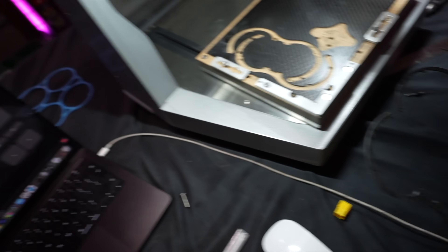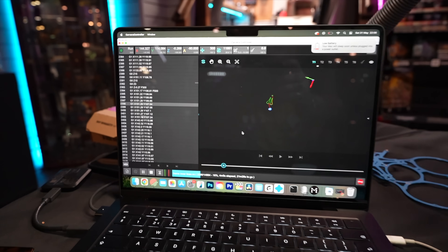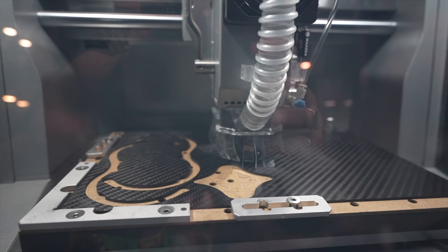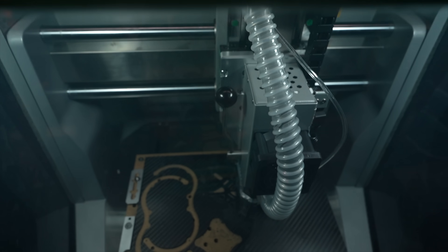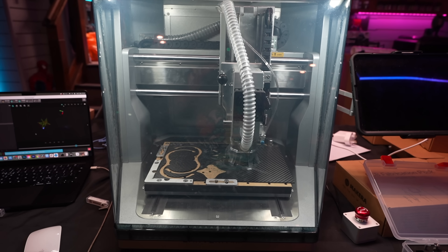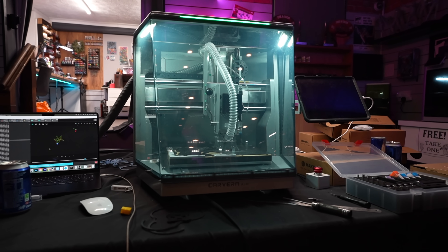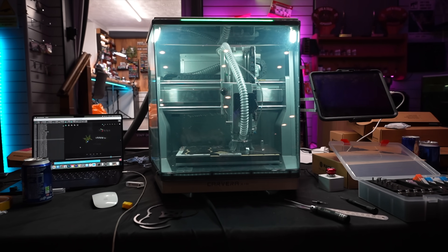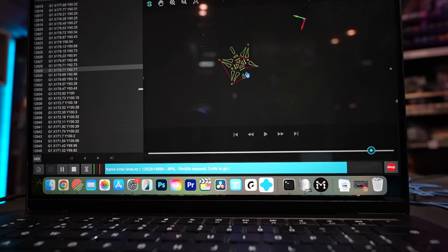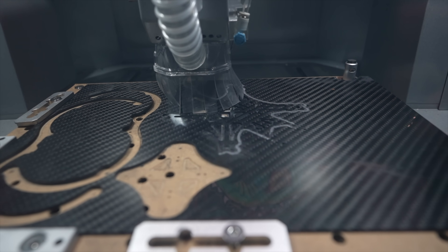While me and George play in adult heaven, I'm going to tell you a little bit more information and specifications about this machine. The spindle's power is 200 watts. Also the speed of the spindle is from 0 to 13,000 RPM with a closed loop control. And the collet is a custom collet with a 1/8 inch integrated option, with 1/4 inch, 6 millimeter, and 4 millimeter. If you know me personally, you know that I am no good with measurements — and this is the kind of machine that you really do need to be good with measurements. But even with my useless measuring, we still managed to get this to work.